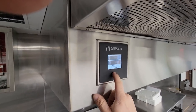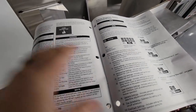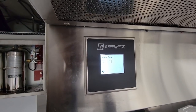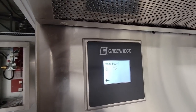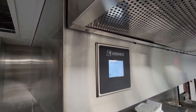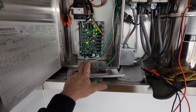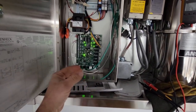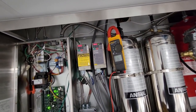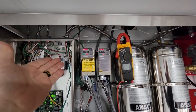I think these are where you're programming the system. I've not done this particular controller but we're getting into it. It looks like I've gotten into the right spot, but the temperature is all over the place. First time programming it — went in and told it there was only one sensor. That second sensor was confusing it. Went in, told it one sensor, it would not reset on its own, so I killed power, brought it back on, and immediately it started working. Turned on the fans and took it to 30 Hz.